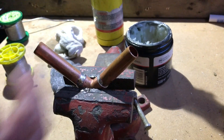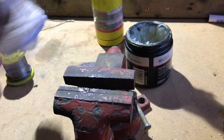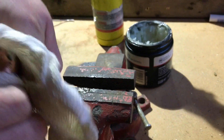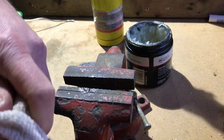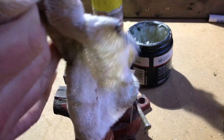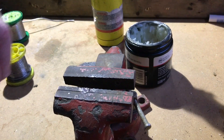So that is now nice and cool, we can touch it, it's fine — it's a little bit warm. So we get the rag and give it a wipe, a nice polish up, to get rid of all that dirty solder and flux that's overrun the fitting. Obviously the pipework will nine times out of ten be in place anyway when you do it.